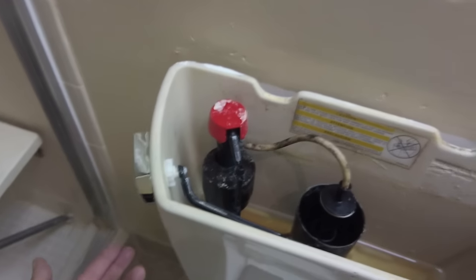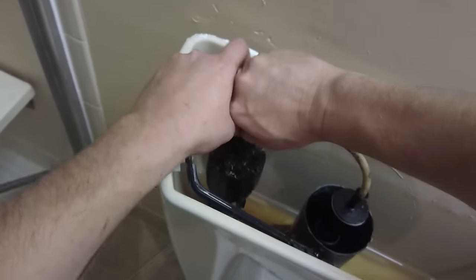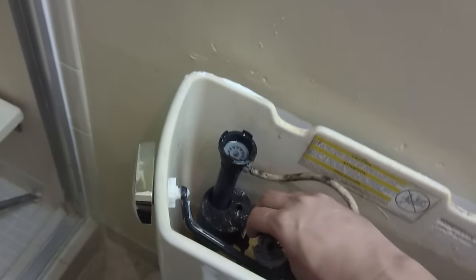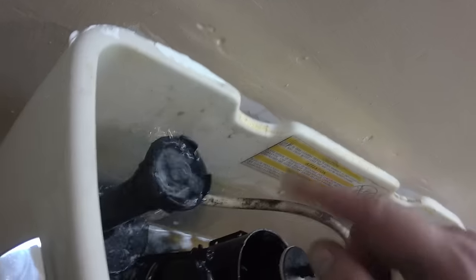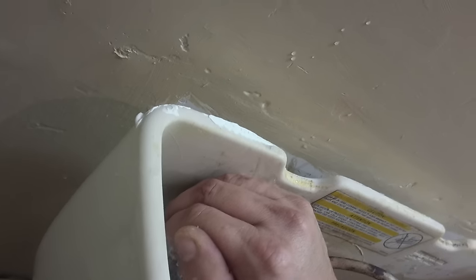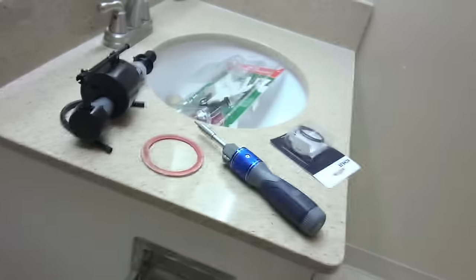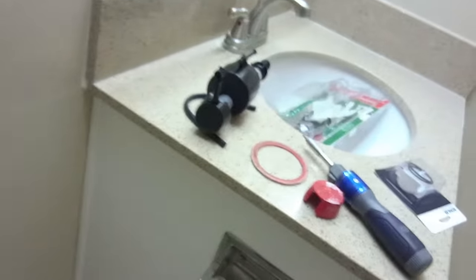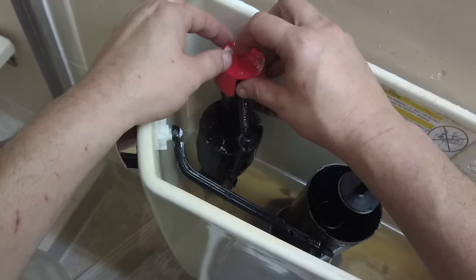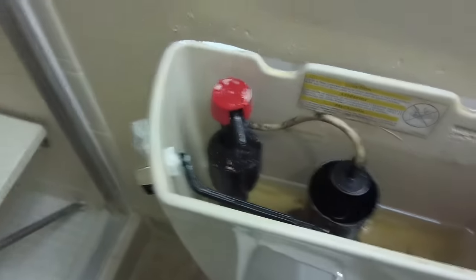As far as slow filling — flush this out. You can take this cap off. Easiest way to take this cap off: flip this over, put your hand over this, and just go like that. Just crack the valve — you can go a little harder than that, I'm just doing that for effect. Get some water going through there and that should flush out all the debris, if any. Come back, put the cap back on, flip it over, put your red cap back on. Or if you have a yellow cap, it's going to be a slow fill. This one I think is considered a medium fill.